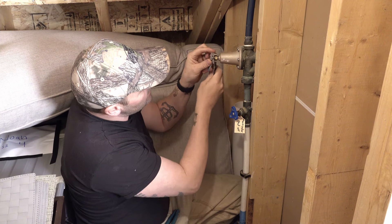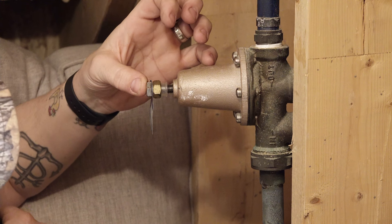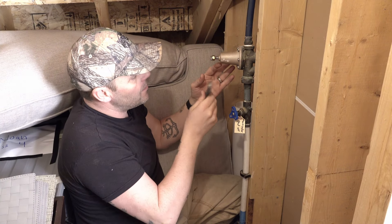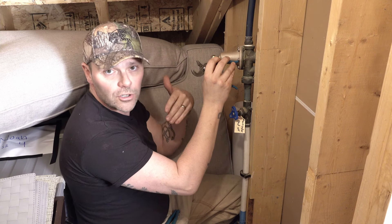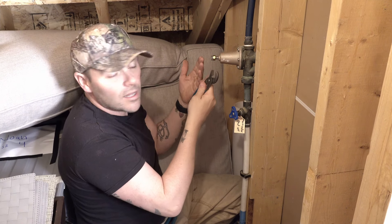So here's what we're going to do. This brass nut closer to the body needs to be loosened off and brought essentially all the way back to the nose or head of the tightening screw. Once it's there, it allows us to then crank the screw in. The theory here is: screw goes in, pressure goes up; screw comes out, pressure goes down.